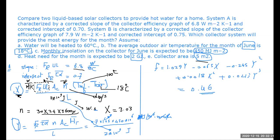And this is why in the program I was telling you about, which is the red screen, based on the F factor that it calculates, it recommends a certain number of collectors for your system. Then you have the freedom to change the number of collectors. Suppose that you are solving a problem and it has recommended 8 collectors to be used, and it has given you a solar fraction or an F equal to 0.46.